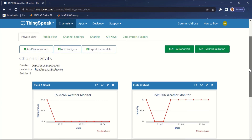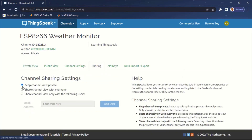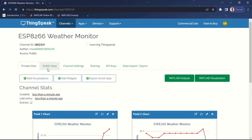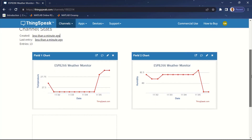If I increase the temperature on my DHT11, it's going to be reflected here in real time. That's basically how to send data from the ESP8266 using DHT11 sensor data to ThingSpeak. For now this channel is only in private view. If you want to share the channel with colleagues or friends, go to 'Sharing' and click 'Share channel view with everyone'. Wait a moment and the status will change to public. Then grab the URL and share it — anyone can have read-only access.